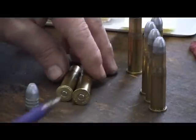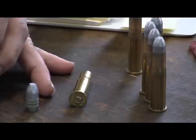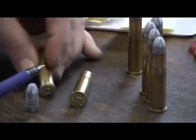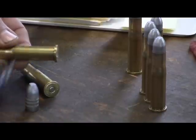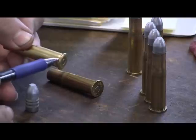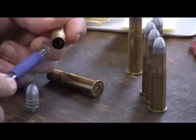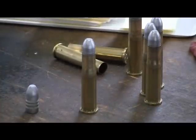The brass I have: I have the Jameson brass, which I like, and then I have this other brass which has been formed from .348 Winchester. If you notice, they put a little swage on that edge because it's a pretty thick rim for that cartridge. When they were forming the brass, the rim isn't thick enough, so they swage it a little — the face is here and then they swage it so you get your thickness, kind of like a modification. Plus, the thickness of this brass is also about .003 per side, so it's .006 thicker overall. So I'm leaning towards using the Jameson brass. That's what the cartridge looks like with that bullet on there — it looks pretty good.